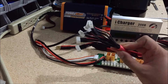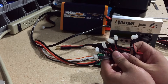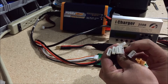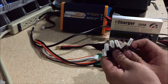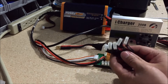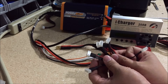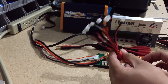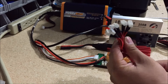Here is a JST wire — all these are plugged in parallel. We have four 4S JST plugs. There are four pins and then one ground pin, so you have five pins in total for 4S, four pins for a 3S, and so on. You can get this wire from hobby stores, Hobby King, or eBay. This one is a six-parallel cable for JST connectors for 4S LiPo packs.